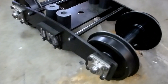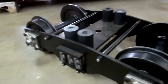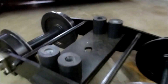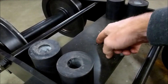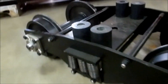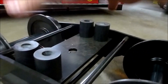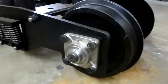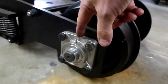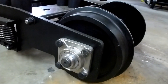These are your rolling stock bogies, ten and a quarter. They're pretty simple, don't need a lot of maintenance. The things you will need to do on a regular basis is grease these rubbing pads in the center. You'll also need to make sure you've got plenty of grease in the hole and on the pin on the wagon for the swivels. This top plate moves up and down, so these sections need to be greased as well. It has fully sealed bearings in a self-aligning housing. You can use the grease nipple to put grease in around the bearings.